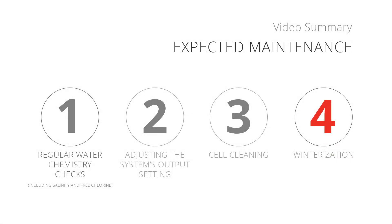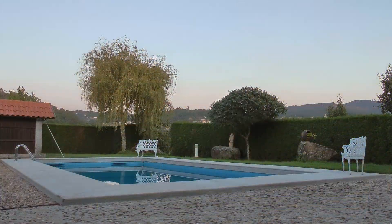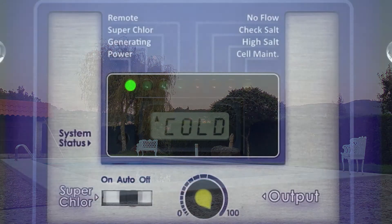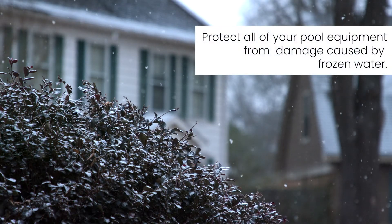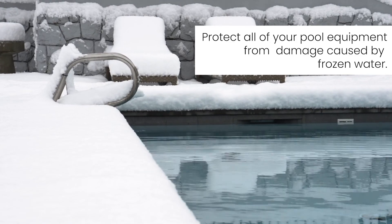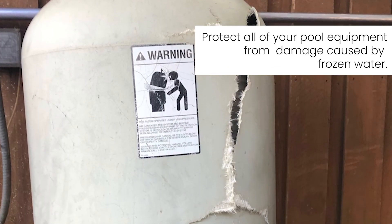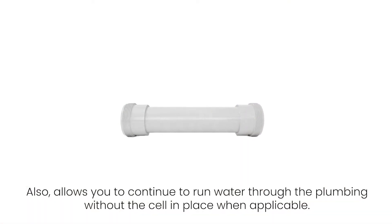Number 4: Winterization. During winter months, very little chlorine is necessary at low temperatures. If your water temperature drops into the mid-60s, your chlorine generator may reduce or stop its chlorination in order to extend the lifespan of the cell. In climates that require you to close your pool for the winter, you can continue to follow all standard procedures for your local area in order to protect your system from damage caused by frozen water. Optional winter bypass cells are available for purchase, which allows you to close off your pool plumbing after removing your salt chlorinator system.